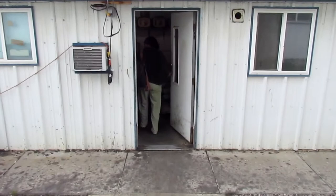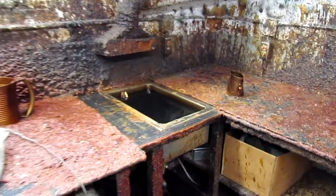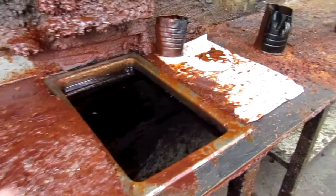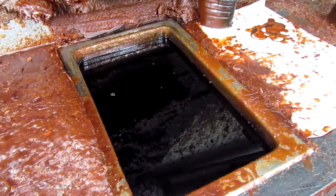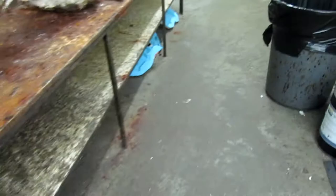We're going to go to the wax room now, where they take the rubber mold that Matt makes and pour wax into it. These are molds up here waiting to be poured into. They have one pot of wax that's hotter than the other — the first one has a finer coverage for the initial layer of the mold, then the cooler wax thickens it up. Here's a mold that's had wax put into it — that's how they get the hollow wax.